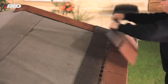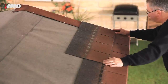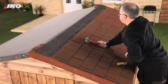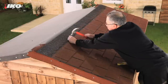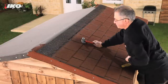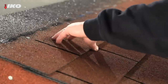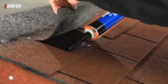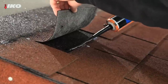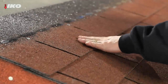Use whole shingle strips for the second and all even numbered rows to create a staggered effect. Nail them 25mm above each cutout and 25mm in from each edge. The bottom edge of each row should just overlap the top of the cutouts in the shingles beneath it. For square butt shingles there should be about 145mm of each tab exposed, or with hexagonal shingles, leave 135mm.